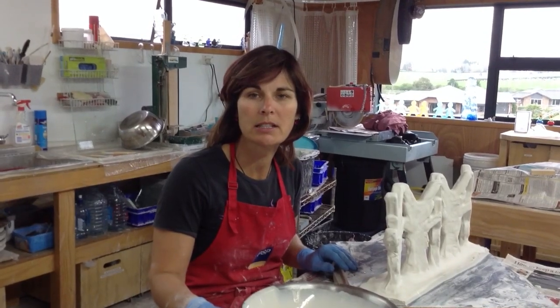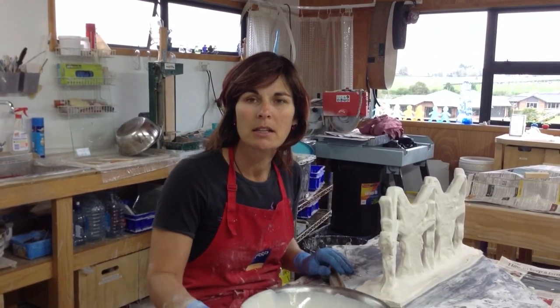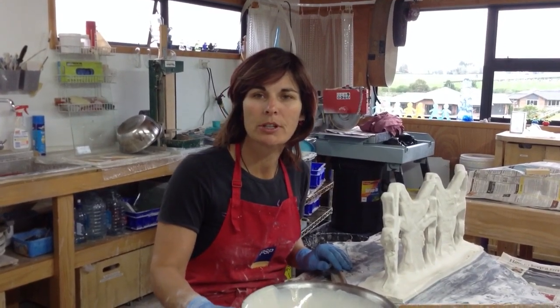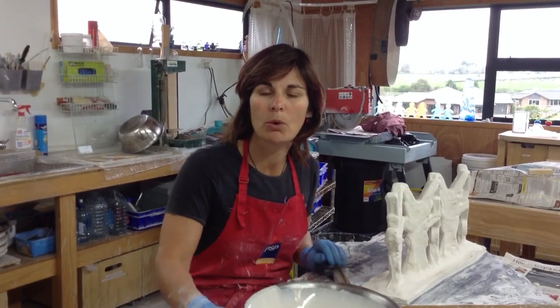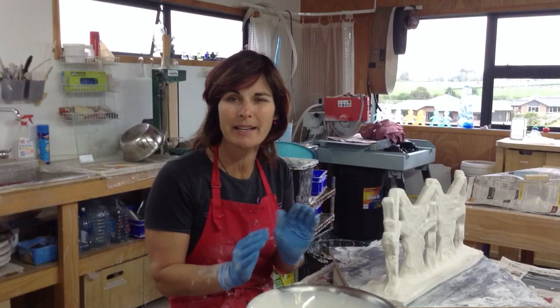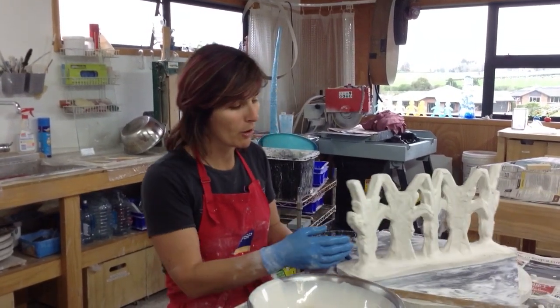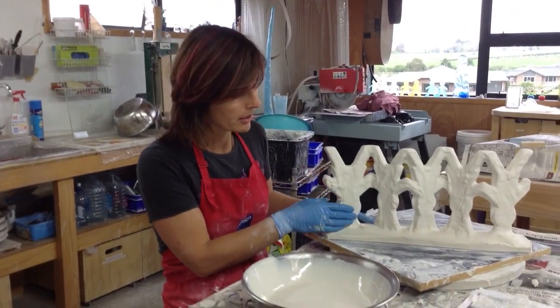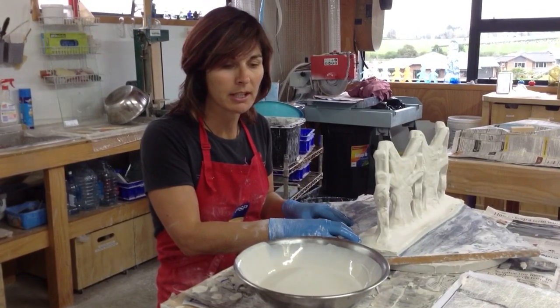I'm Daitoka of Dyecast Glass and today I'm going to show you how I use fiberglass chopped strand mat 600 in my molds for glass casting. I use it quite differently to a lot of other glass casters in that I use it to make a skin after my first layer on my mold. I've already put the first layer on this rather intricate-looking mold here and I'm now about to apply the skin layer.